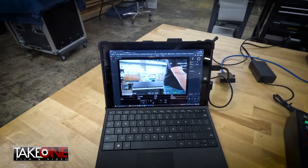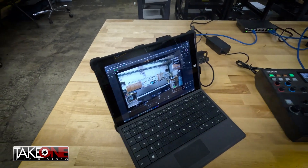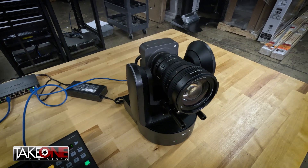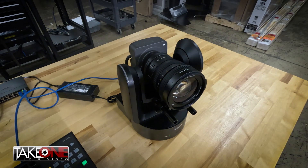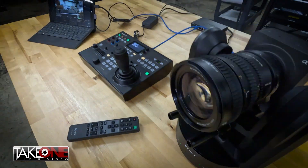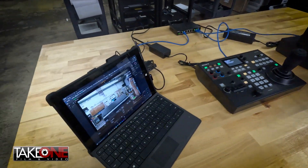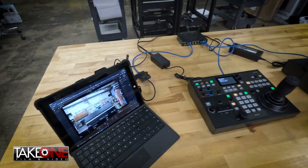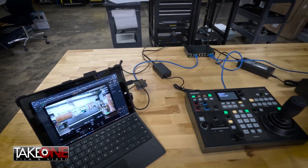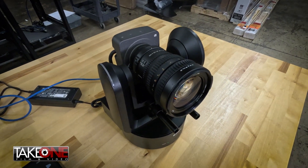There is also a Windows laptop here — I've connected this with my MacBook Pro over Chrome and it works just as fine. You'll need this to do an initial setup. It's easier if you put the camera on a network with DHCP that hands out IPs. It's set to DHCP by default — it's looking for you to give it an IP address. There's a little cheat code on the door: it actually has a QR code. If you scan that with a tablet — I tried it with an iPad mini and it didn't format correctly — but it works perfectly on a Windows tablet or a MacBook Pro. You can configure the whole camera, set static IPs, and do everything you want through the GUI. So basically, you have a cinema FX6 camera on a PTZ head and you get to pick the lens you want, which makes it awesome.